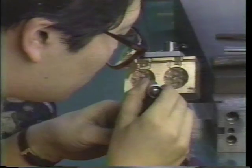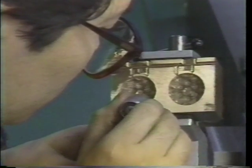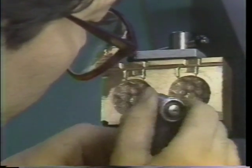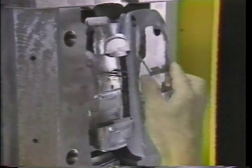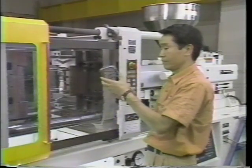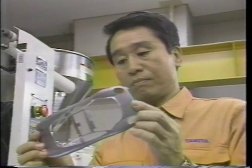After going through the process of being machined, dies are then manually finished. Intricate parts may require careful hand grinding. After dies have been hand finished, they are assembled into the forming machine to make a test part. Final adjustments and finishings are then performed.